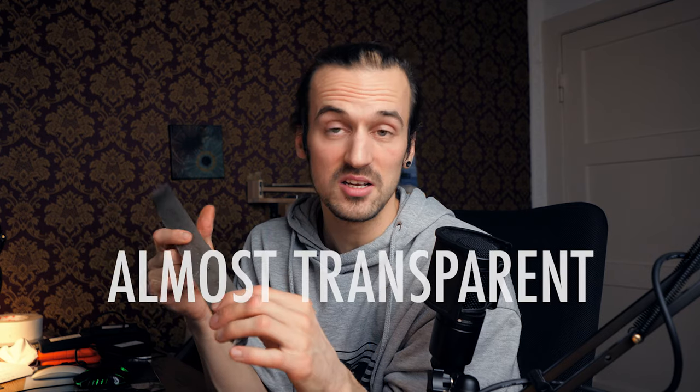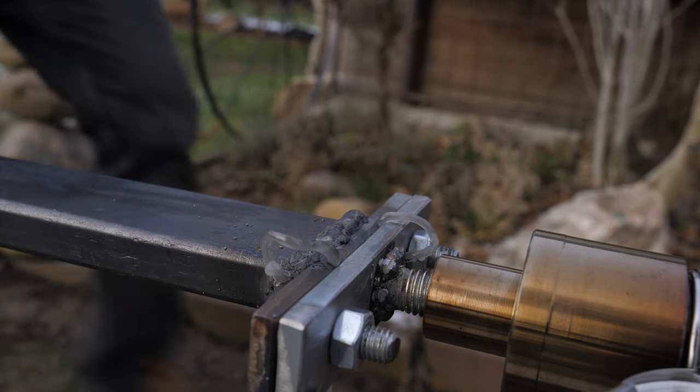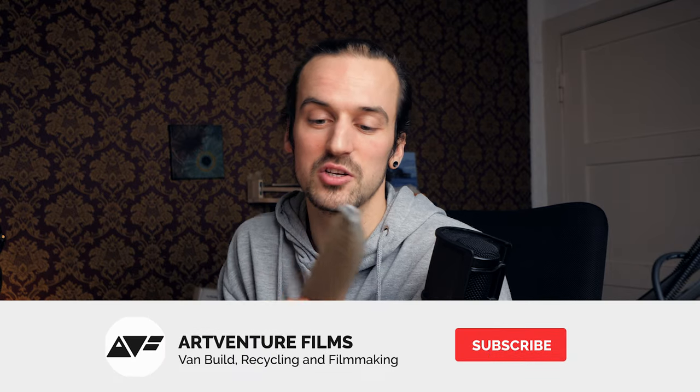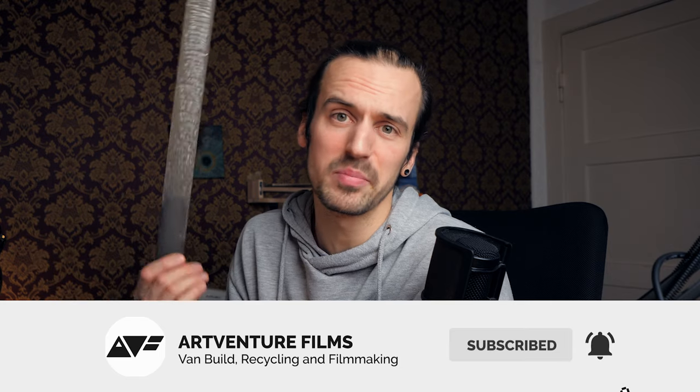I actually got it here. The plastic used was PP, it was transparent. So when you have just tiny bits of that, which is not so thick, it is transparent, but as you know, this one's pretty solid and pretty thick, so it just looks gray and ugly. The plastic came out on the thing that we made here, or on the other one. So we kind of have to improve that a little bit, but that's off to a great start because we actually managed to extrude some plastic.